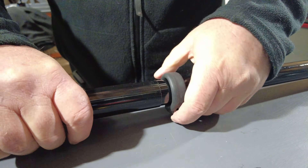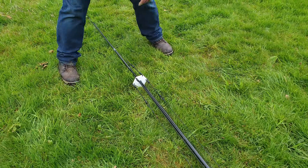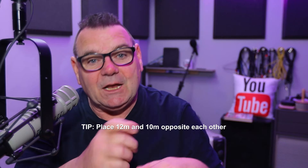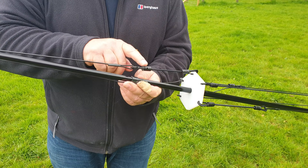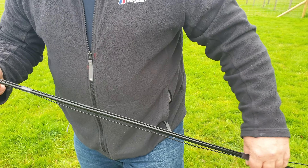I didn't really design this as a true portable solution, but if you're a caravan or camping type and want it up for a night it should handle it fine. Remember to really pull out each section and give it a good twist. Have some sympathy for the engineering — with the shock cord tensioned like I did there's a lot of downward force. The 30 meter element goes up to the five meter point where the 20 meter element is under tension with shock cord. To stop the top sections floating around, we supply a little bit of aquarium tube in different sizes — just slip them over and that will keep the elements nice and tight.